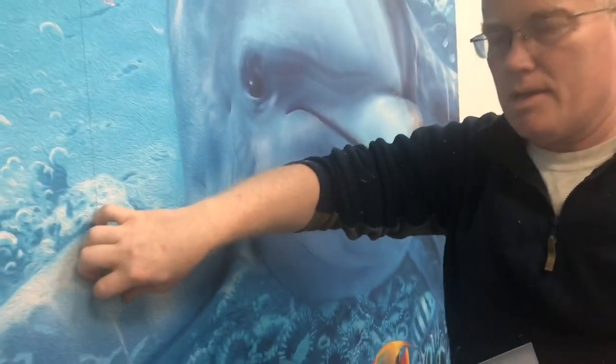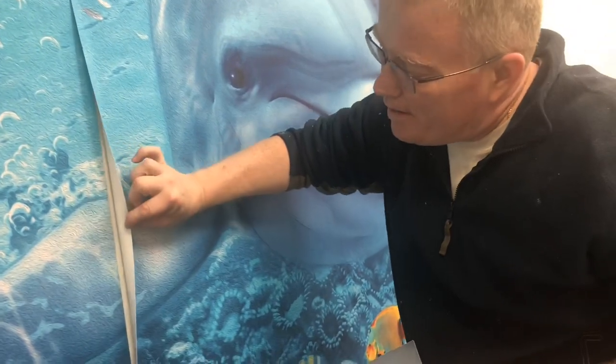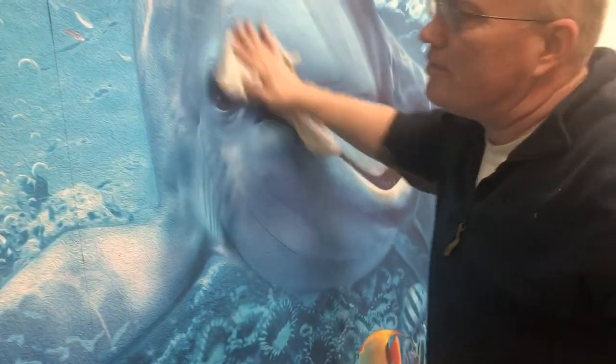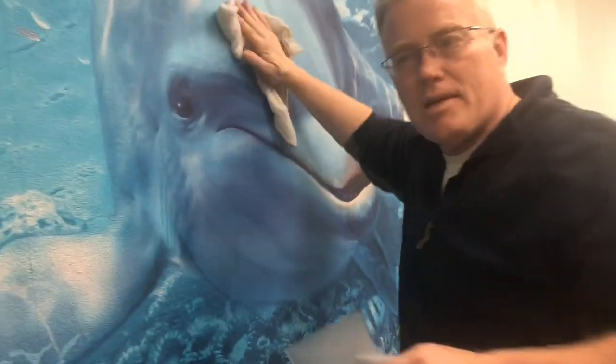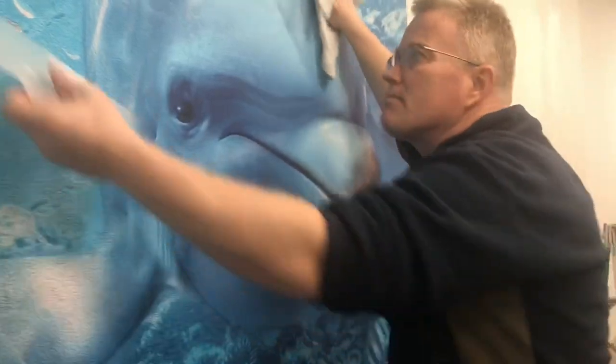You need to let this book for half an hour. I don't play games here with these. These things take a long time to absorb the glue, and if not, you'll have a lot of bubbles. You have to know your wallpaper in order to make that determination.